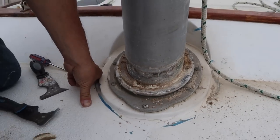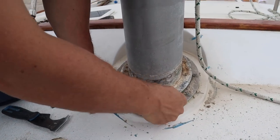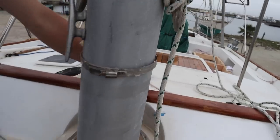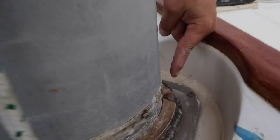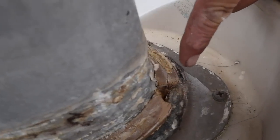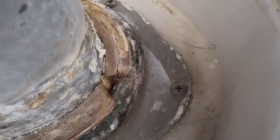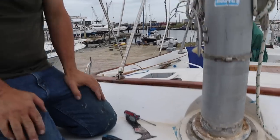So you think there is actually water getting through that? Well, we definitely know it is in the back — you can see the back's got a hole all the way through, right there. That is a physical hole going all the way into the boat. I can see light through it from inside. It needs something solid that is like three-eighths of an inch thick to tap up from below.